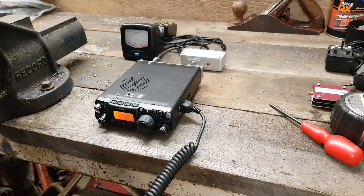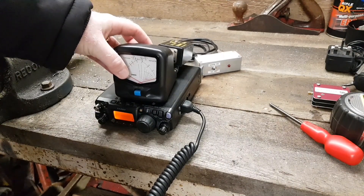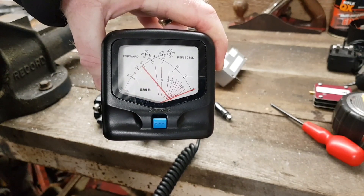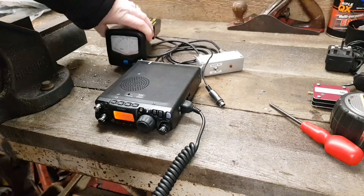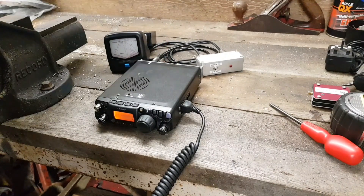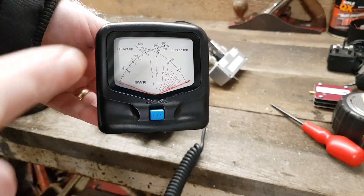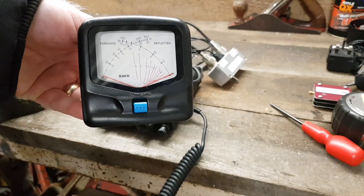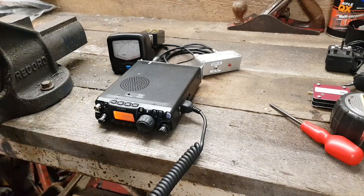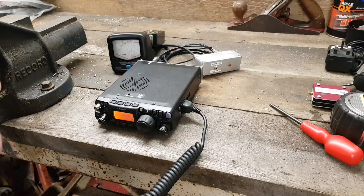It's always going to be permanently in. We're on the five watt setting at the moment. So I'll just take the control plug out to stop the attenuator doing its job — as you can see, we've got five watts because the attenuator is not switched in. If I plug the attenuator switch control circuit back in, straight into the accessory socket of the radio, now it will only attenuate when I transmit. Now bearing in mind this power meter is not calibrated to the sort of power we're trying to record here — we're trying to record about 500 milliwatts, which is showing more like 800 — but that's purely because the meter is too far out of its calibrated zone. The fact is, it is attenuating extremely well.